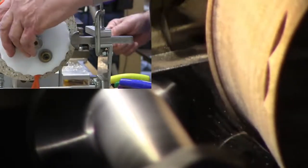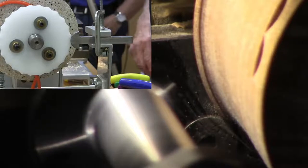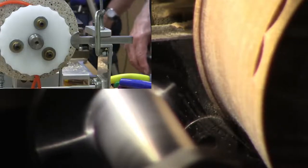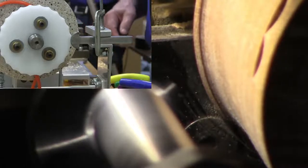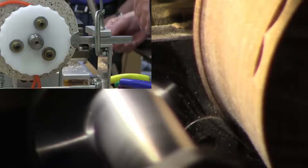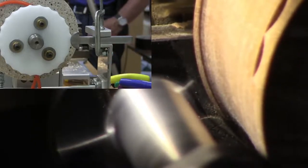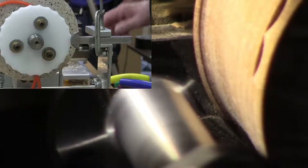So why do you not use this on an automated run? I think it allows the cutter to advance into the wood too fast. And when it broke, that got my attention. That's why it broke. I was going in way too fast. Now, I'm sure you can do it the other way, and other people do, but not Dan Henry. You know, you've heard if you talk to five woodworkers, you get six answers. Well, that was the sixth answer there.